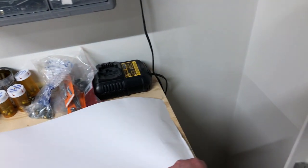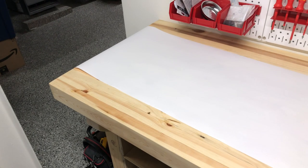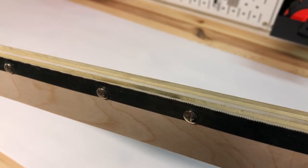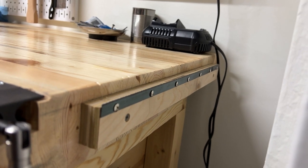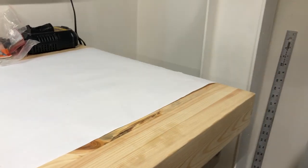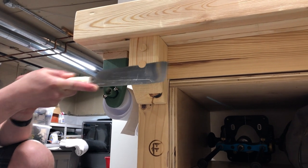Insert your PVC through your roll of paper and fasten your pins to both sides. Now you have an easy-to-change and easy-to-grab paper roll — it's big enough you don't even have to look, just reach your hand over. It's really good for glue-ups, drawing plans, keeping your bench clean. Then, just because why not, I took an old bandsaw blade, cut it down to size, literally screwed it to a piece of scrap ply, and screwed that to the opposing side. Without having to look, just fold your paper over — it's about an inch from the edge — and pull it down. Sure you could use a knife, but that's neater.